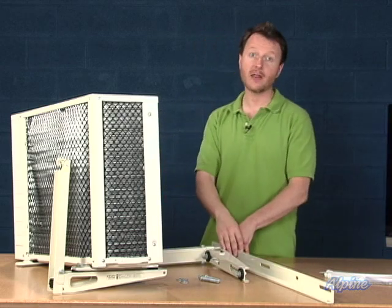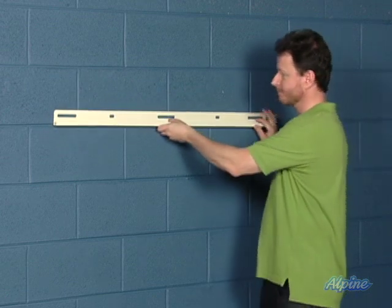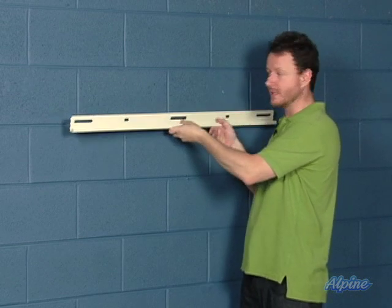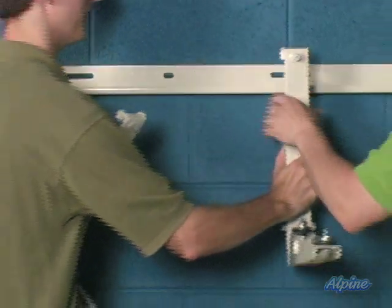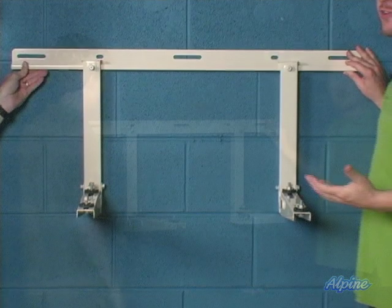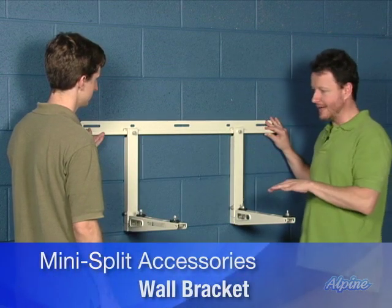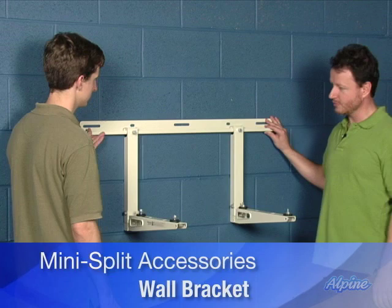Let me show you how this fits together on a wall. Take the straight piece and bolt it to the wall with the bolts provided. The nice thing is that although you're going to have a heavy condenser, it's not going to be an awkward installation because the first thing you bolt to the wall is just this light and easy piece. Once that's in place, put the bracket arms in place — they easily just hang on the unit. They move side to side, with markings as to where to put them depending upon the size of the unit. The last step is to put the condenser on top and secure it with the nuts provided, and voila — it's secured to the wall without a whole lot of effort.